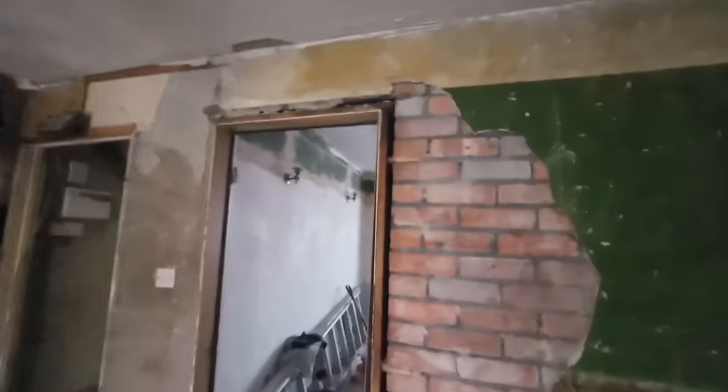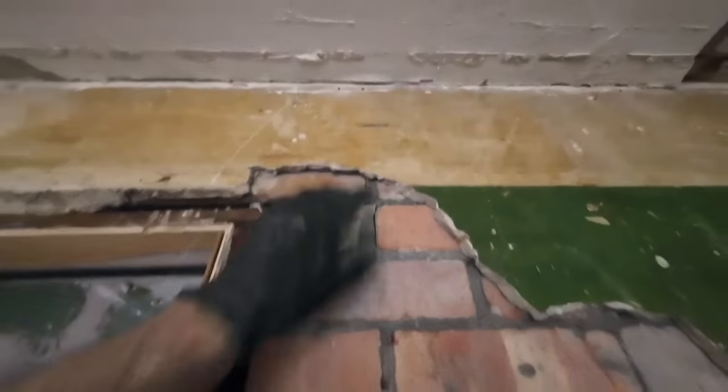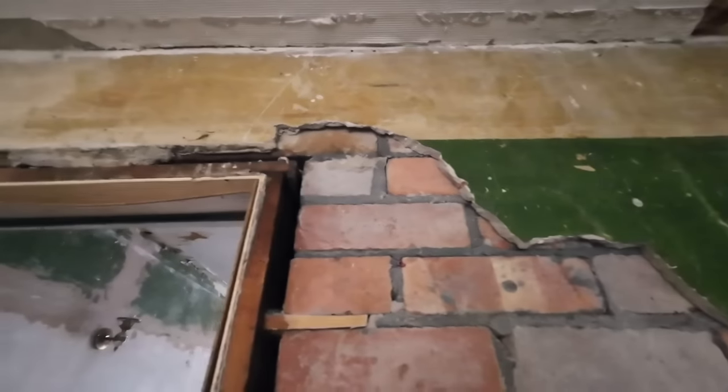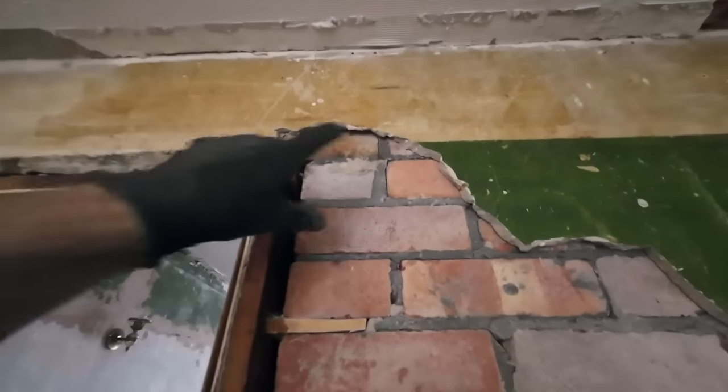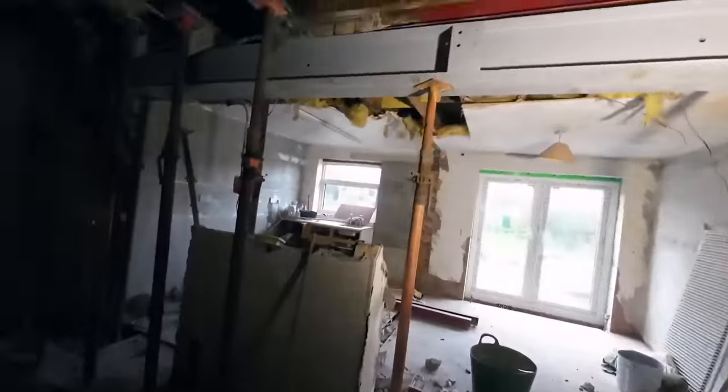But we've still got this to do. The steel to reinsert against this steel, and this, I've had a look at it, and where it lands is about here. So I'm going to pick up a 1500 by 64 concrete lintel, take that timber lintel out and put the 1500 across, and it comes to about here. So that'll act as a pad stone at this end, and it transfers down onto all this solid brick wall. So yeah, it's a big lintel to go in there.